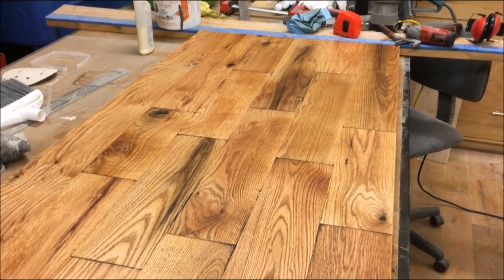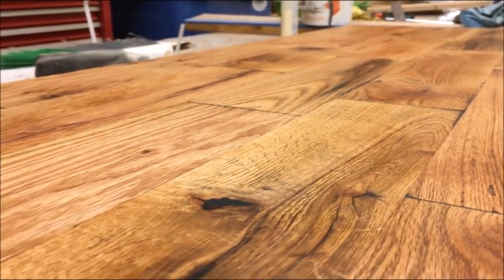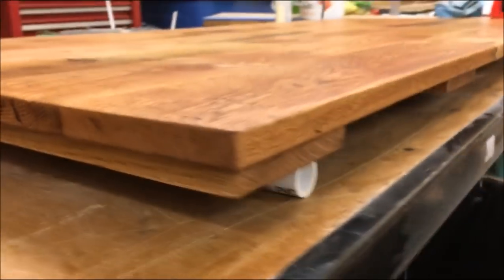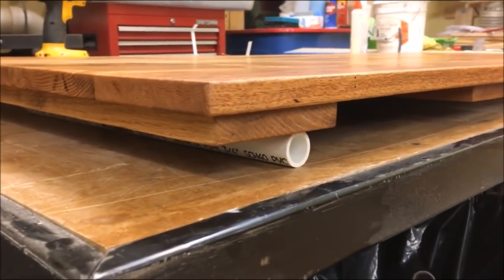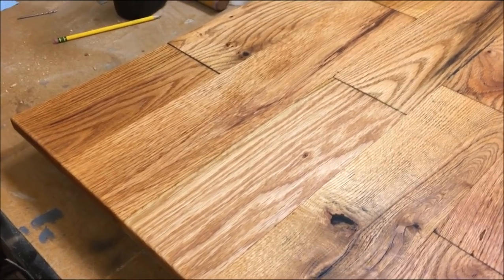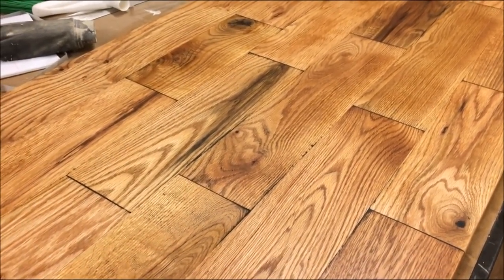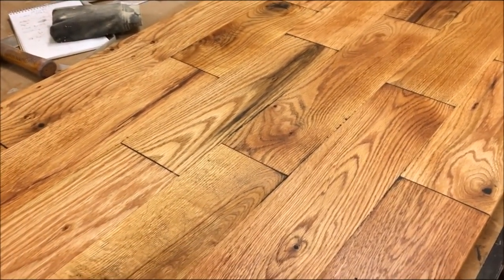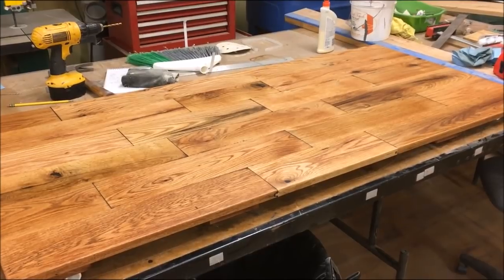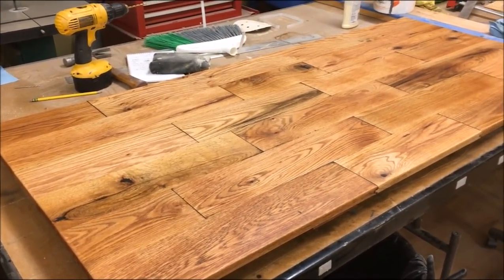There's the top oiled — you can see it's just got a little bit of a sheen, a very satin look. It feels soft, to be honest with you — that is just fantastic, it really looks nice. You can see what I did with the cross members just to keep it flat. So the top is basically done. I'm going to put legs on it as soon as the final fittings come, and then maybe in a day or two, once the oil has hardened up a little bit, I'll put a coat of butcher's wax on it as a final layer. I'm really happy with it — that looks really fun for something that has maybe twenty dollars worth of lumber in it, and for me it was just leftover scrap. That's pretty awesome — that's exactly the look I was going for.